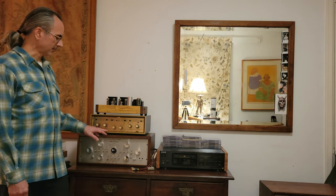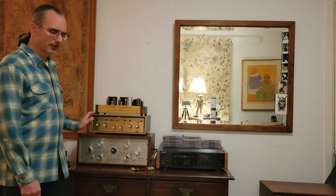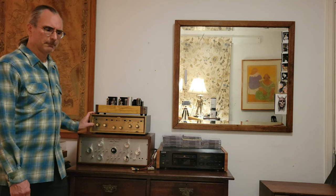Because a lot of the resistors hadn't really gone out of spec, but some of them had. Some of them had gone way out of spec. And I suspect that a lot of the capacitors were really just doing a poor job of what they're supposed to be doing. Although of those oil capacitors that I took out, almost all of them measured decently. So it's a little confusing, the measurements versus performance, but anyway, film caps for almost all of them.